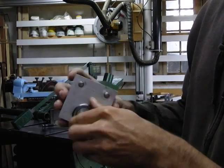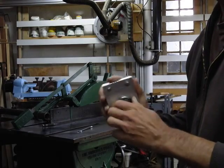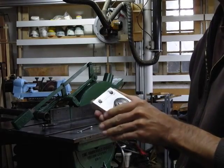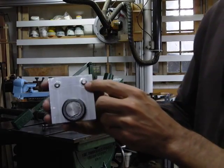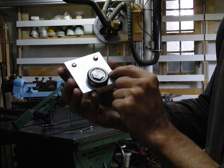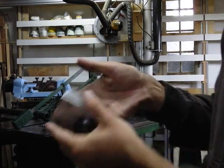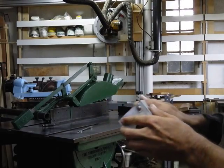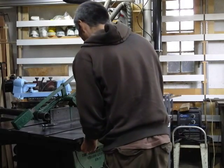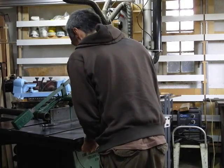These bearings are kind of knackered for high-speed use, but for just something like this — where they're just there to keep the table from diving off — they seem to be working adequately. On the back you can see the layout lines that I scratched into the aluminum to get the position that I wanted. So this is what I did to fix this rather vexing machine problem with this old Tanowitz JS rolling carriage sliding table saw.